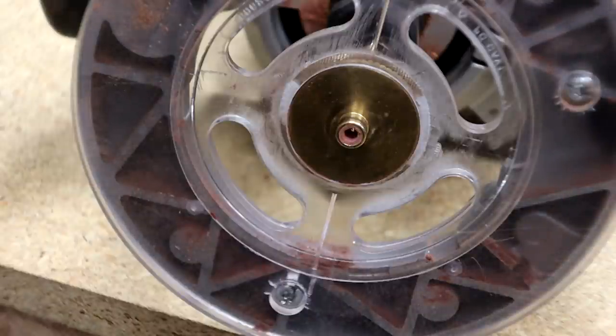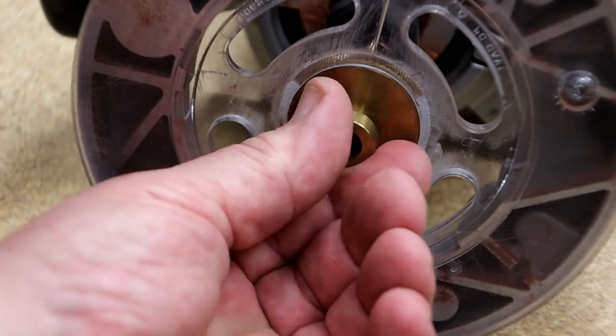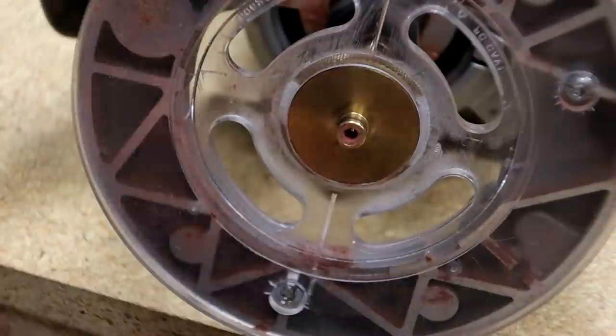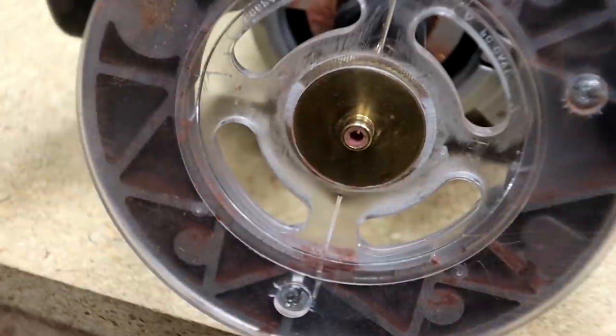So, to cut the inlay piece, you do that without having the bushing on. All right, you take this bushing off to cut your inlay piece using the template. So let me get set up for that and I'll show you how to cut it.